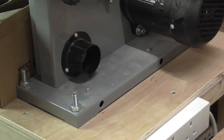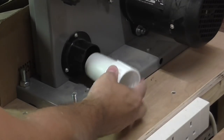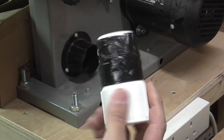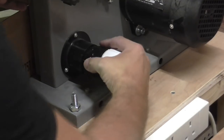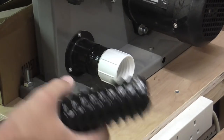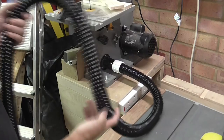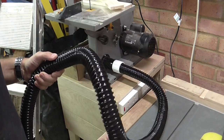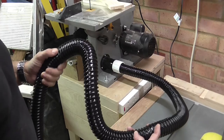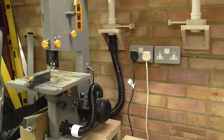The bandsaw has a 50mm extraction port. I bought these connectors that are basically for pool hoses — it doesn't quite fit; it's a little bit small. But I've wrapped some duct tape round the edge to make it bigger and now it's quite a snug fit. I've got a 38mm pool hose that I'm going to attach to it, giving myself quite a bit of slack on the hose to connect up to the blast gate, because I want to make sure that if I need to move the bandsaw around or out away from the wall I've got enough slack. So that's the bandsaw connected to the blast gate.